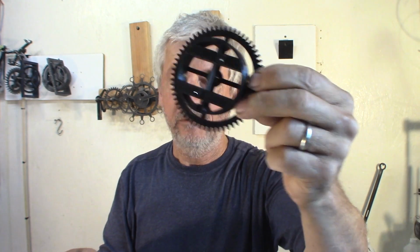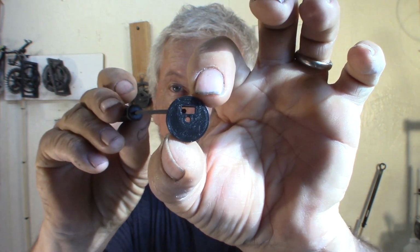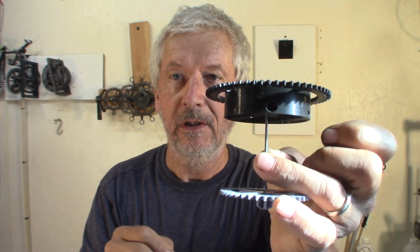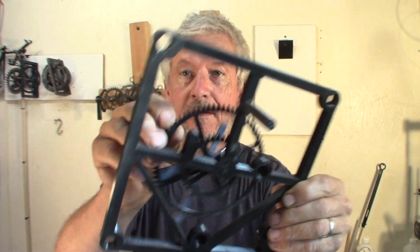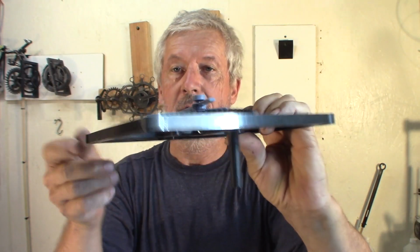And then there's a last part that will hold this washer. Again, there's a hole, so you can put a nut in here. Get the nut in the hole, hold it, and then the screw can come here. And that will prevent this arbor from coming out of the clutch gear. There's one more metric 3 screw for the middle shaft here that holds the hands. This in front here. So when I put this across, I can secure it on the front frame so it doesn't fall out.